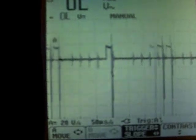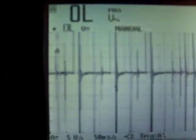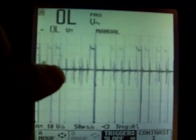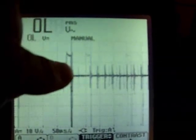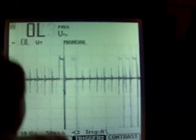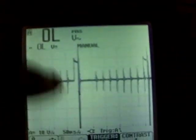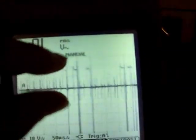I have not been able to get it with this circuit. But basically if I zoom into these spikes in between the pulsing, each one keeps increasing in amplitude — up and up and up — until it gets to the on-pulse spike, ringing. It goes: oscillation spike, spike, spike, and each of the spikes keeps getting higher and higher in amplitude, and inversely true on the bottom. So it kind of goes up like this.